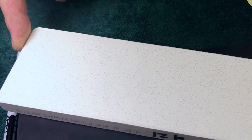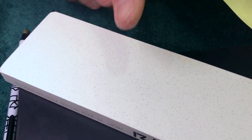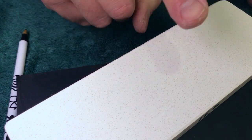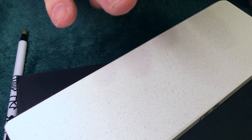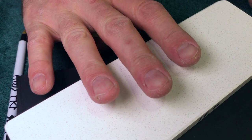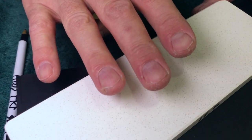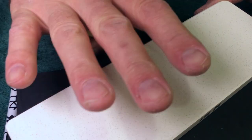Now, mind you, I'm not big on synthetic stones in the finishing range, but I will say this. 12K Superstone, as a rule of thumb, not with this one, as a rule of thumb, they're brain dead easy. You make the investment, you flatten it, you don't have to ever do more than 15 passes, really. Maybe 20, 22, maybe 25, but no more than that, because if you dig your groundwork, you don't need more polishing than that. And then you're golden.